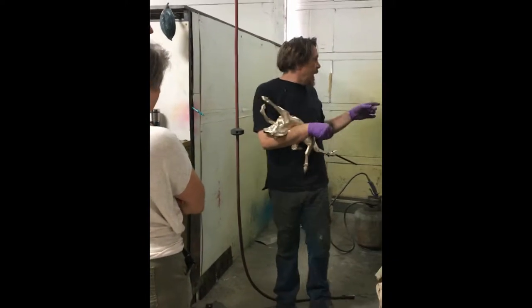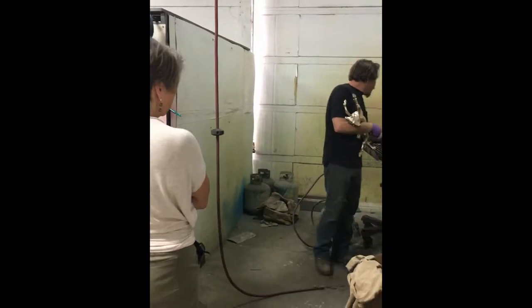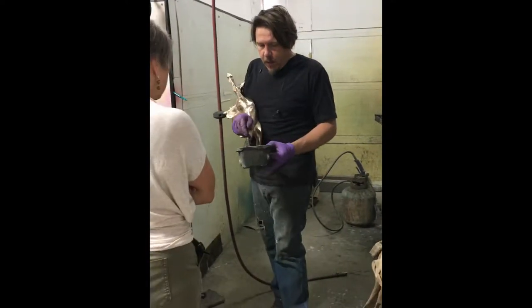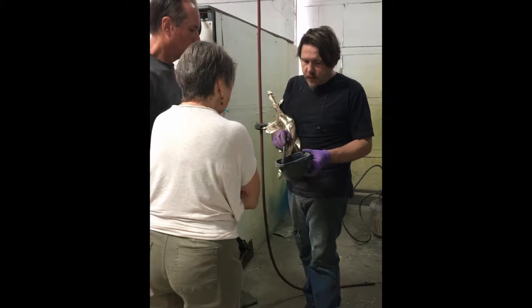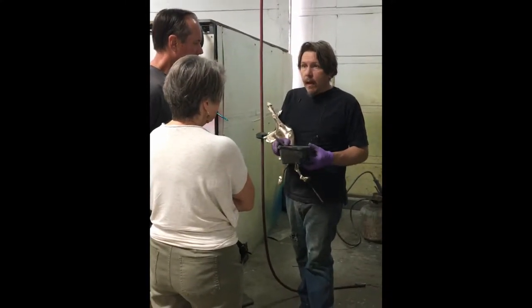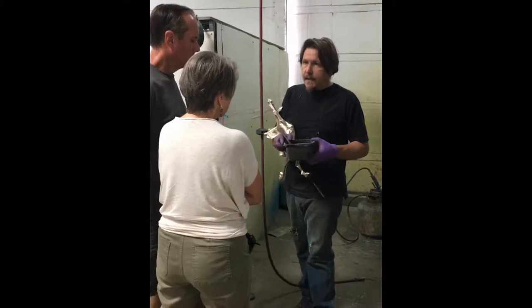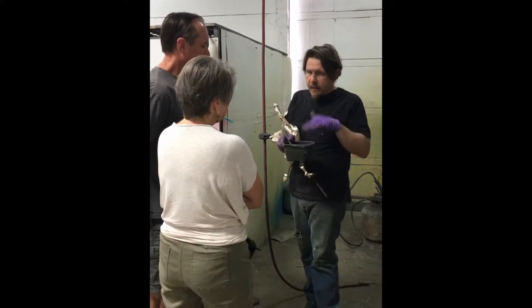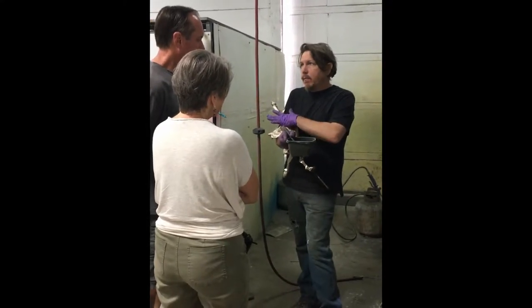And then we take a combination of black ferric oxide, which is really just laboratory controlled rust. So iron rusts in three different colors, black, yellow, and red. And so they can isolate which colors you get. This comes as powder. This by itself won't stick to the bronze.